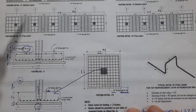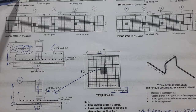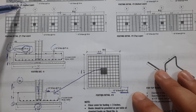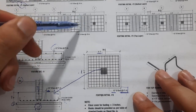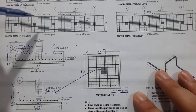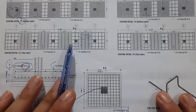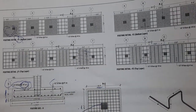Footing one details — spacing and reinforcement are the same as described. These footings and columns are connected by steel reinforcement ties, which are single mesh with lengths of five feet, five feet eight inches, and five feet, as you can see for the different footing connections. We have different types of footings and their details are shown here.